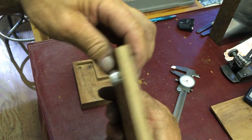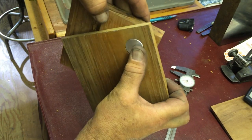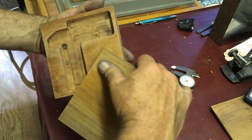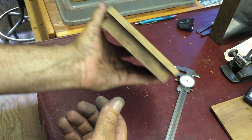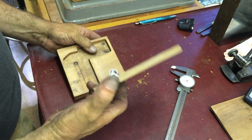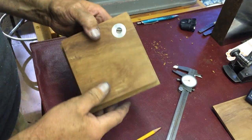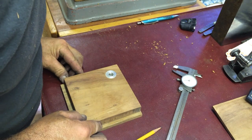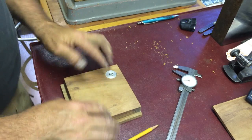I made that flush also for the depth. Here's a little test fit to see how that's going to go. We still have some sanding to do on the box and the finish of course. I still need to trim the box lid, so we'll be marking that out, cutting it on the bandsaw, and then sanding all the edges together at the same time.